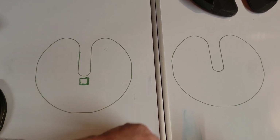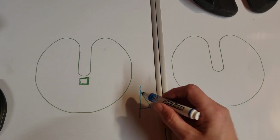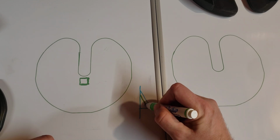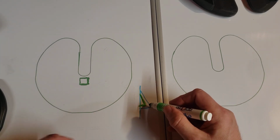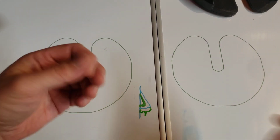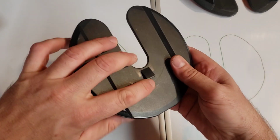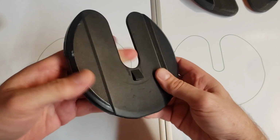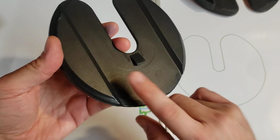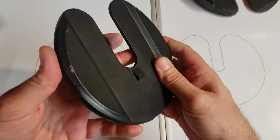So basically, you go from, let's say this was your tab before. Actually, let me draw that up a little higher for you. Let's say that this was your tab before. When the plastic cover breaks off, the underlying tab in steel is smaller. It's in here. And as a result, there's not enough meat right here to hold on the discs that I sell, or on your OEM discs. So this is very unsafe when it happens to your plates because it allows the plates to potentially slip out of your discs. It's one of the reasons why I'm going to look into making steel versions or metal versions of these plates, because that shearing is a safety issue on the sets that have the plastic tab.